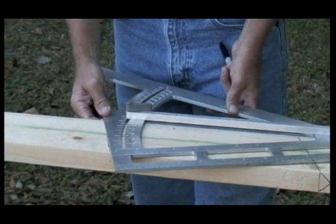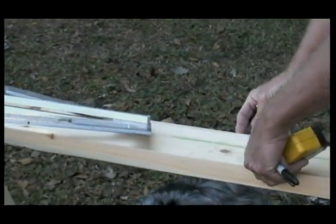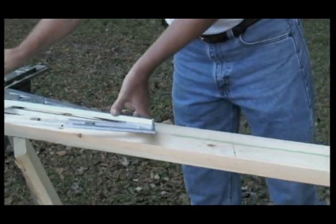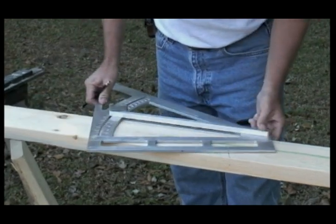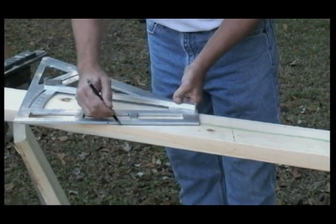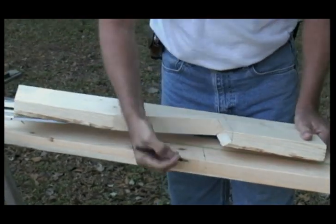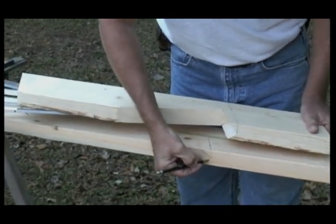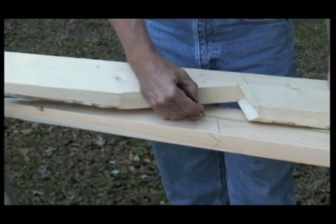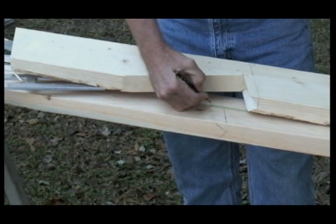This was the mark of the corner of our building. We're going to continue that line all the way to the top edge, then mark that two and one-eighth inches that we just discussed, and draw that line all the way out to the face of the bottom edge of the member. I want to remind you that this could wrap around the corner of the building, but there's absolutely no need for that. This three and a quarter inch dimension right there is very important, and we'll need it later — we'll refer to it in other videos.